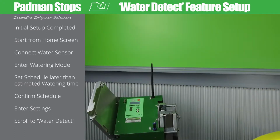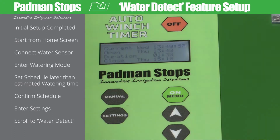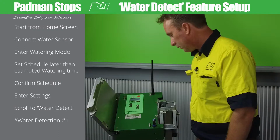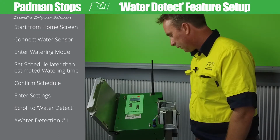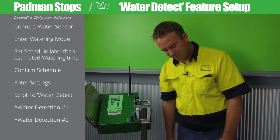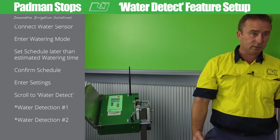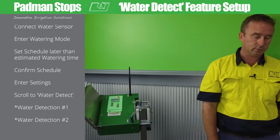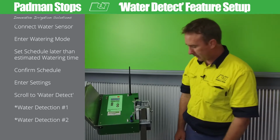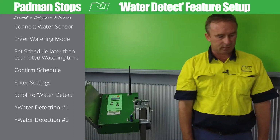So if I do this, I've put water on the water sensor. It's saying water detected. It detects it something like 3 times before it triggers the event, just to make sure there's no false triggers. And once it does that, it'll fire off for the duration that you've set it for.